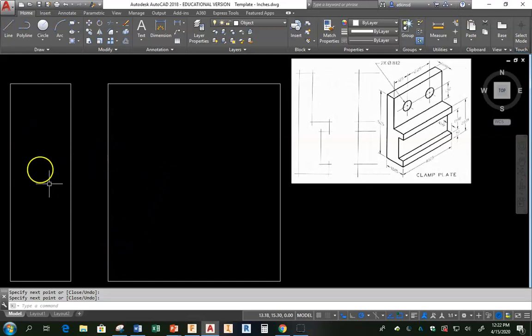So now we want to lay out this front view. This bottom lip down here is up 1/2 inch. Okay? And then it goes back into the object 0.438, which is 0.4375. Okay, so I'm going to hover here. I'm going to go up, and I'm going to go up 1/2 inch. And there's my start point, and it goes back in. I'm going to use the numbers they've got just to make it simple on you, but it's 0.438.